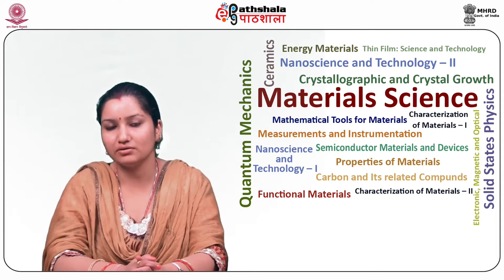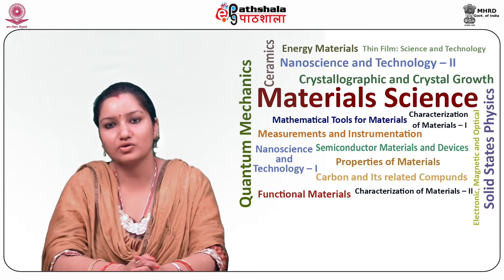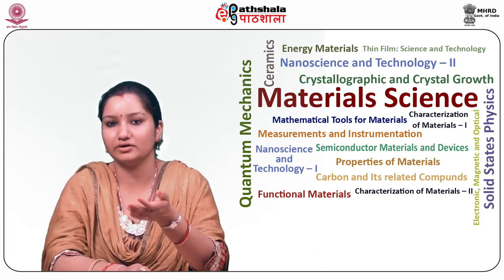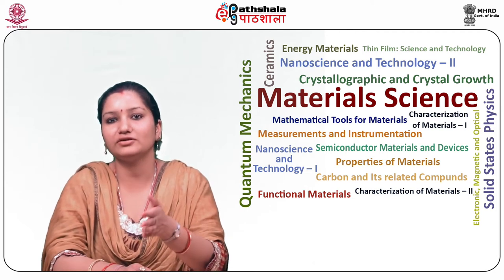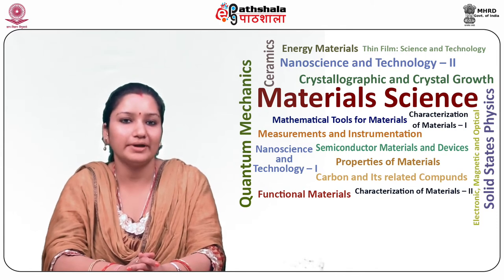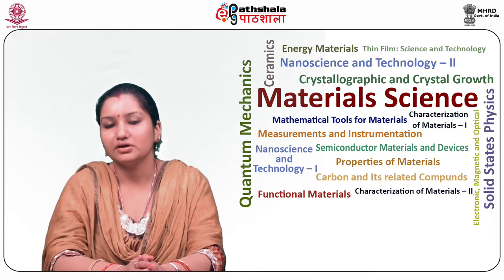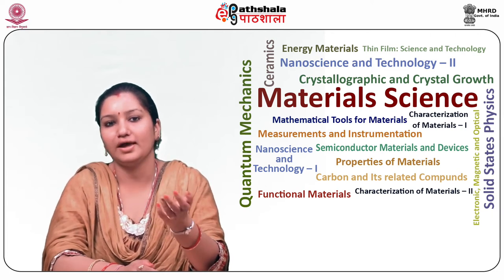The field resolution of SQUID devices is 10 to the power minus 17 tesla. The device can be operated at cryogenic temperatures with quantum limited sensitivity. In the development and commercialization of ultra-sensitive electric and magnetic measurement systems, superconducting quantum interference devices or SQUIDs have been considered as a major factor. In many cases, no methodology works to measure magnetic properties other than SQUID. In the present module, we examine the main features of developing, constructing and operating SQUID measurement systems. Materials used to fabricate SQUID sensors, with the various types of SQUID sensor descriptions, as well as the operating principles and properties are listed below.